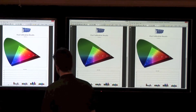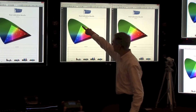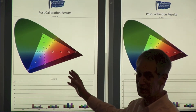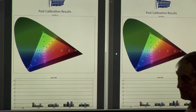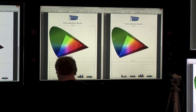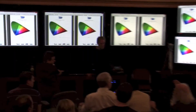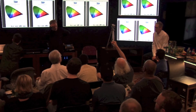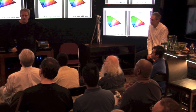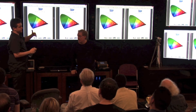Well, no display can do it anyway. No display, regardless of technology, can go all the way out here or here. Part of the reason is that you lose luminance — if you push that green out there where you get a really good green, it's not going to be very bright. And that's an interesting point because in the original NTSC standard, they wanted to have the green way out, but they couldn't do it because the phosphors were too slow.